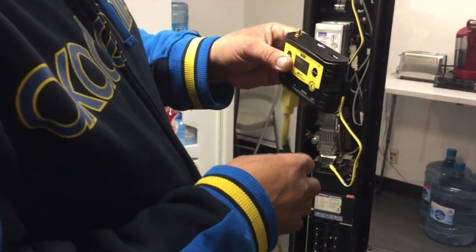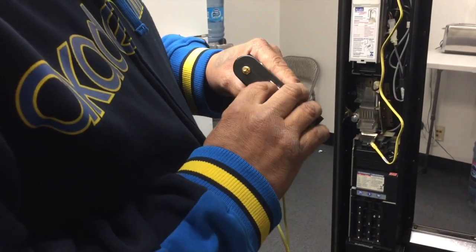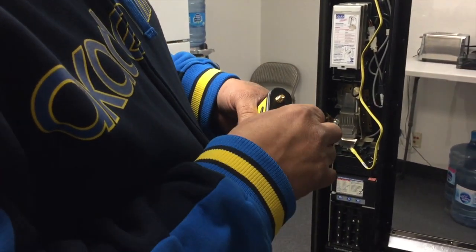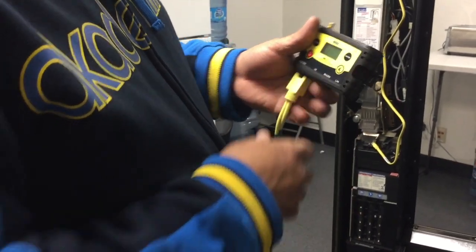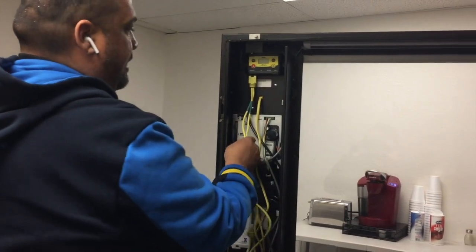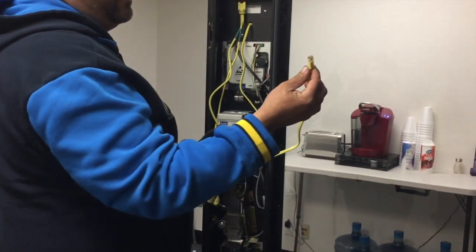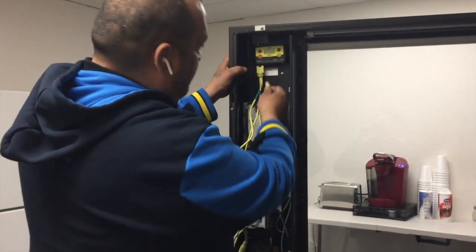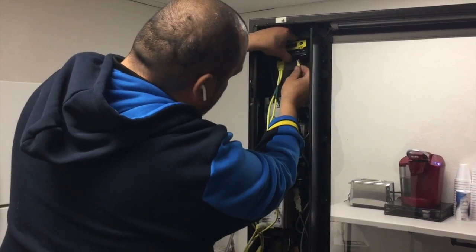Click that in, make sure it's good. What I like to do with these before I really mount them and power them up is take out the SIM card, just push it back in, make sure it's clicked in. You're going to kind of mock this up right there. You got this cable here for your communication from your reader to the modem — that just goes in there like that.